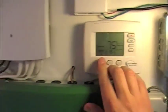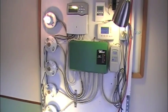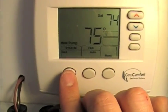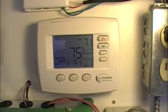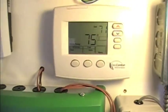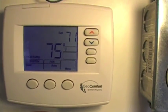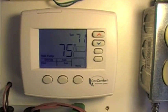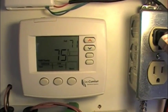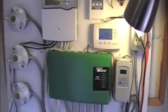That's the basic thing here — we'll shut the system off. If you shut it off, the O terminal stays energized until you move it back into the heating mode. So we'll go back over and turn it into the heating mode but leave the thermostat low enough so there's no call — it'll shut that off now. Anyway, that's a few of the things to be aware of when configuring this thermostat. This one's labeled Geocomfort and was sold with a water to air heat pump, but it's made by White Rogers. We'll put the model number below and a link to the PDF file. This is James with Thermal Battery Systems — thanks for watching.